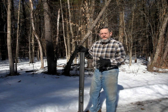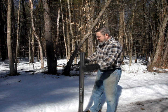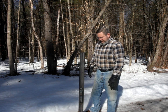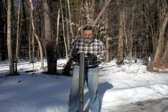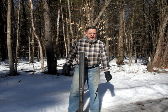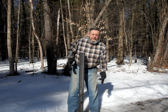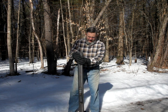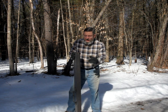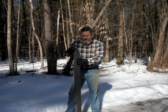If you're trying to lift anything substantial with a device like this, it's very important to make sure that it's supported laterally so it doesn't fall one way or the other. With an unbalanced force on our chain — 600 pounds going one way and 1,800 going the other — we need something to prevent the chain from being pulled over the edge. That's why I've used my plasma cutter to cut this notch here to capture the link of chain.